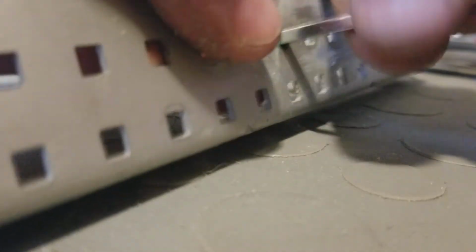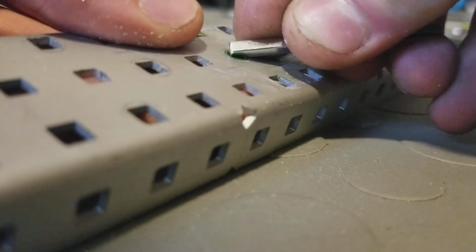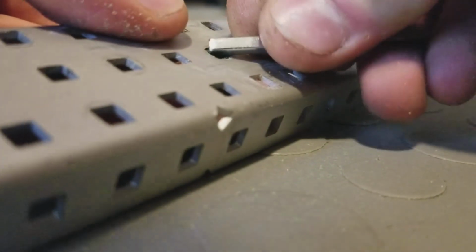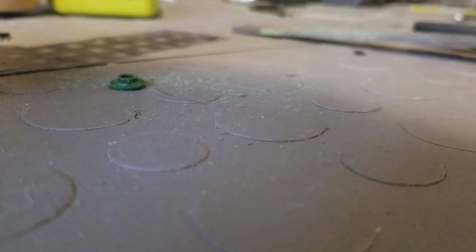So if you wanted to make this shaft turn a lot better, like right now it's really, really stiff, what you would do is file it down inside the drill press again until it gets looser, to the satisfaction you want. That made sense totally. And then once it's looser, which this one came in a lot easier, it has a less tight fit. This one actually is pretty smooth. And if you make it so loose that it just drops out pretty much all the time, then your shaft will be able to turn pretty quickly.